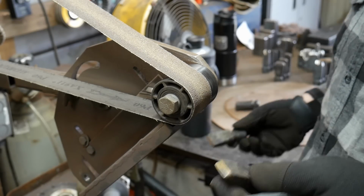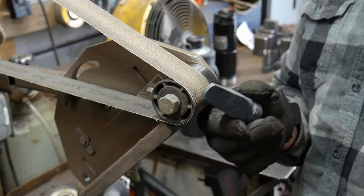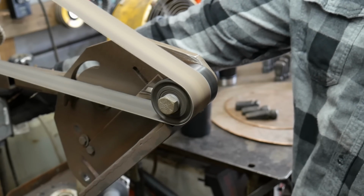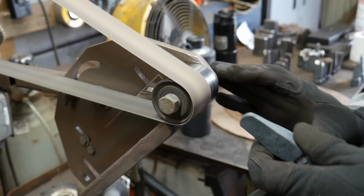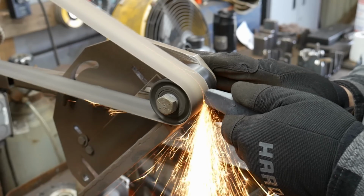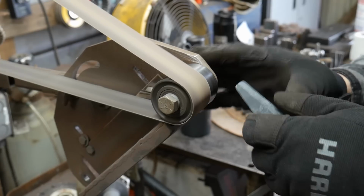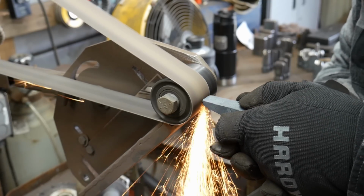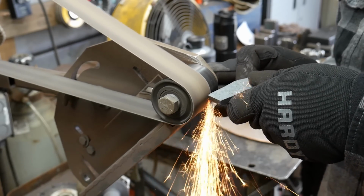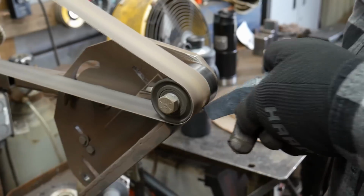So in this video we are going to be forging, or rather grinding, a small straight butcher. As you can see, I already have this piece forged out. This is part of a collective series, a playlist series that I've done around a bunch of chase tooling, and I've skipped over the forging part for this video because it was a bit redundant, as basically all the tools, unless otherwise notated, are forged the same. Basically drawing out a taper to the rough size that you need, and then it's the grinding that makes the tool interesting. So that's where we're at right now.